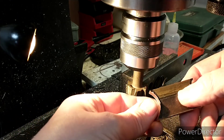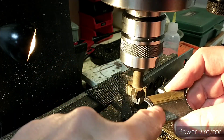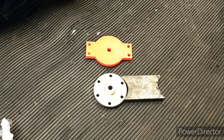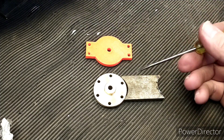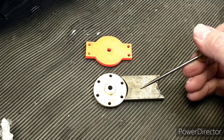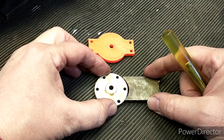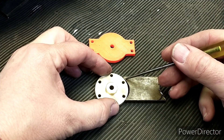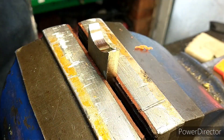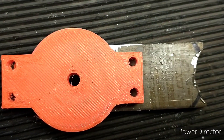I didn't have a cutter that was exactly the one and a half inch I needed, so I've come in with the cutter and gone across a bit to try and get roughly the right shape. I've sort of free-handed this on the milling machine and got somewhere close. We need to remove a bit from the edges to get a nice close fit on the top, so we'll get the file out and see how we get on. That's the first side done — it doesn't have to be super accurate because we'll machine it to the correct size later.